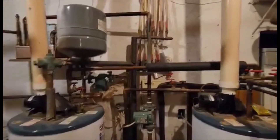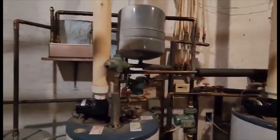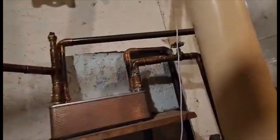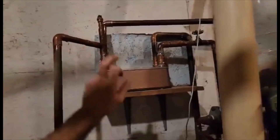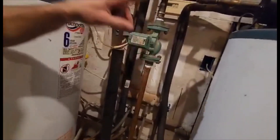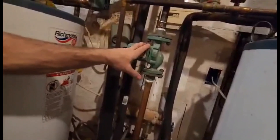Okay, it's all done and it really wasn't too bad of a project. Got to play with some copper - I was able to reuse the whole existing stem, which was surprising. I didn't need to buy any of the reducers because those stupid pieces are like 15 bucks a pop now - copper is crazy expensive. This is our water-to-water heat exchanger. Coming in right here is one-inch pipe from the boiler - this is the supply line running it over into our heat exchanger, back out, and down and back to the boiler.